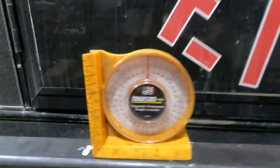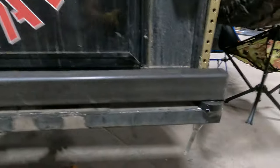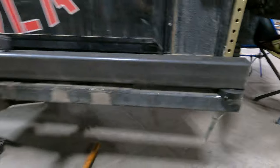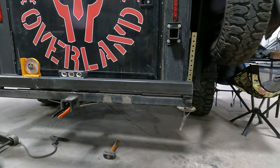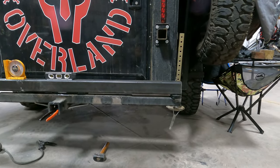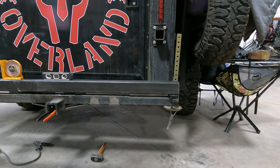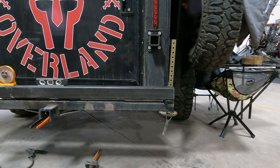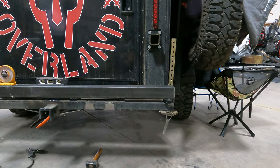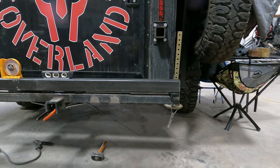Get you guys off the stand, check this out. Anyway, what you see there is zero, spot on level. The funny thing is, it was a roll of black tape that created an exact level surface. So I'll take the measurement of that and add probably an eighth to it, because there's probably a little sag in that tape, and I'll create a spacer built out of that. When it comes into the locking mechanism, it'll rise and come into it, about an inch and an eighth taller. So as you swing open, swing close, it should swing right into the gate capture.